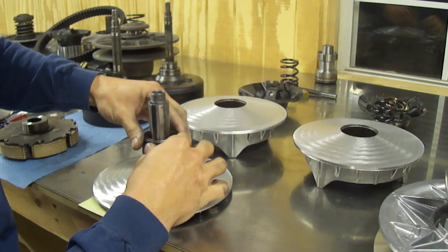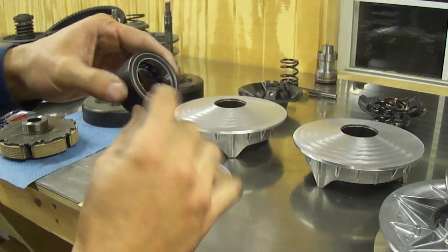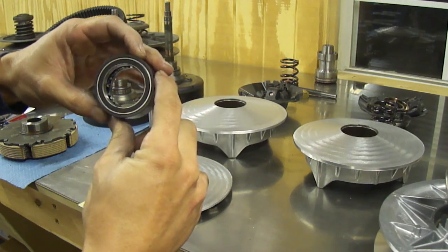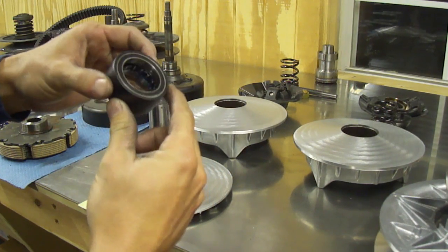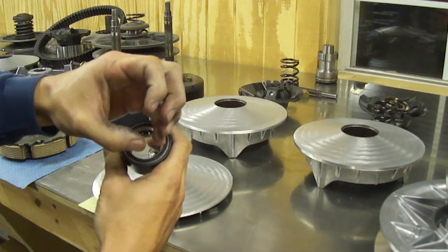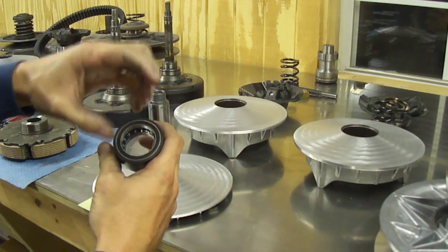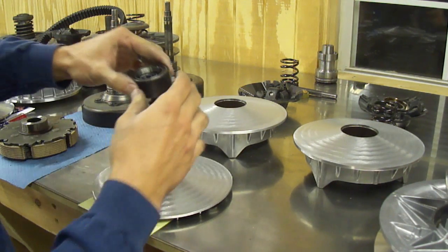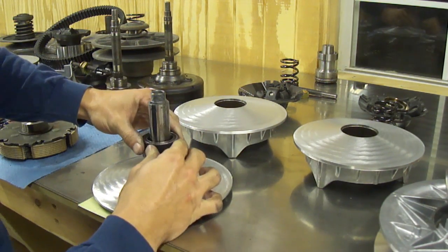To install the one-way bearing, you need to notice that you have little fingers in there. These are the sprag teeth. They are spring loaded and pushing outward — actually they are trying to push towards the center. In order to make these teeth go over the shaft, you have to push each one individually, one at a time.